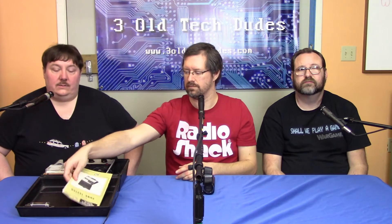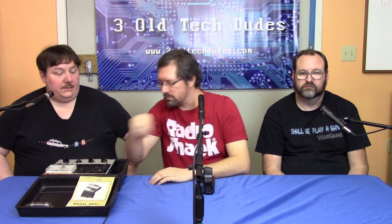So anyway, this thing is pretty basic, but it'll tell you if you have a bad tube. So if you have, like, a guitar amp or something that still uses tubes, or old tube radios, finding one of these things working — or finding one and getting it working — would be worth your while, just to have a way to test the tubes that you have. There are still tubes being made. Some people think there's not — there actually are. I'll be using one of these in some videos coming up when we get into some more antique radio restorations or revivals. I don't totally restore them usually. I need to do some of that too. More repairs. Got to repair stuff.